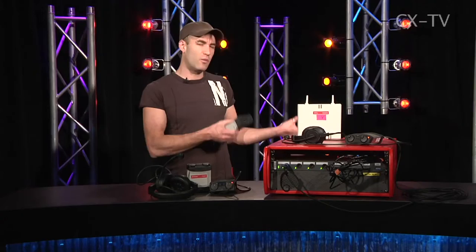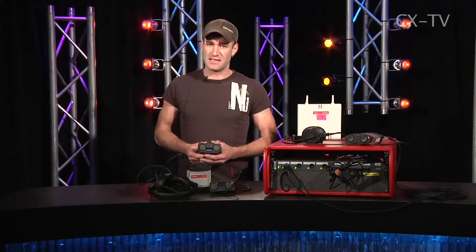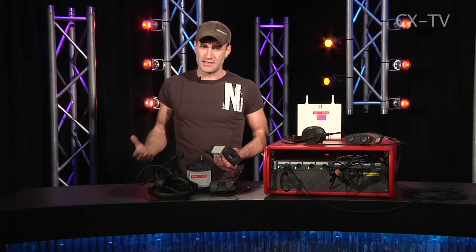The clever thing about the cell-based system is that you've got one master antenna and then you hang the other antennas off standard power-over-ethernet switches. The system isn't fussy about this at all — it's not even particularly fussy about what kind of cable you use, so you can potentially run it in multiple areas of a venue using existing Cat5 building infrastructure. The only real restriction is that your antennas can't be more than three hops away through switches from the base station.